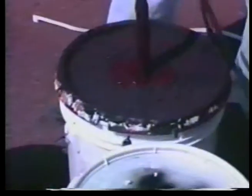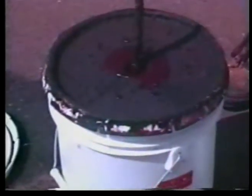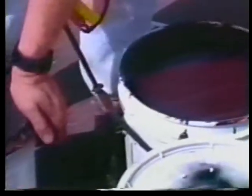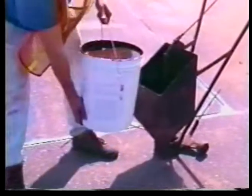After stirring the sealant, place the paddle mixer in a bucket of water. Seal the lid. Stir for about 10 seconds. This will remove loop sealant from the mixer and prevent buildup. You're now ready to seal your loop with TA-500.